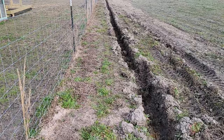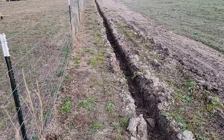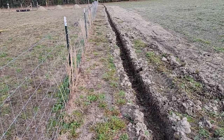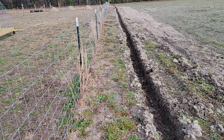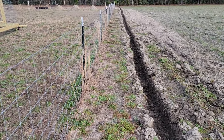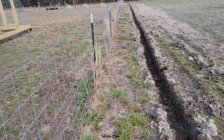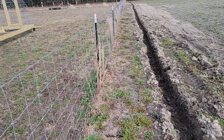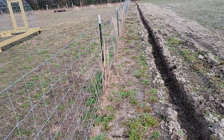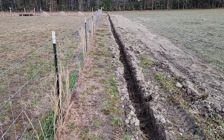After the trench is done, we got a box blade, and it was recommended by the dealer to put the box blade on so we can cut on both sides. You literally stick the tractor down in the trench and the box blade will conform to that angle, so we should have a nice angle going on both sides, and then we have our little swale.